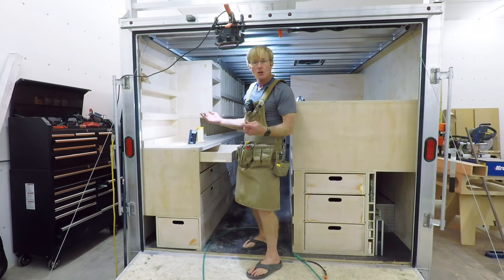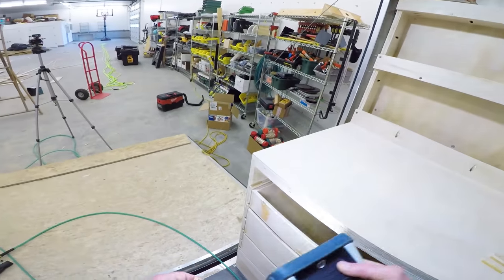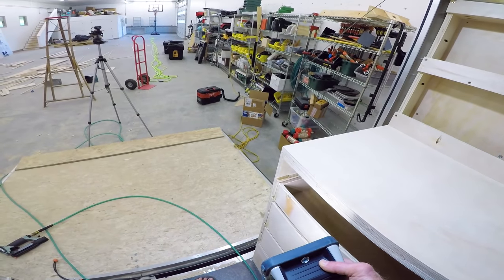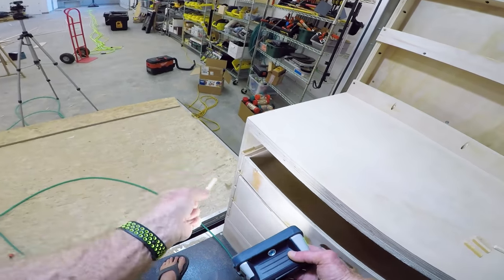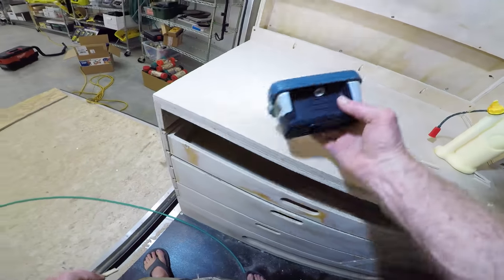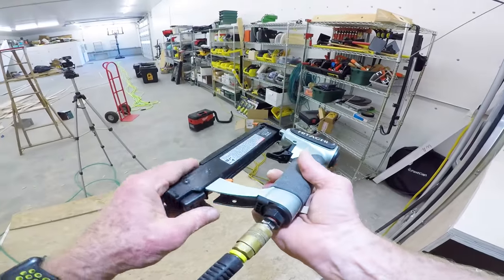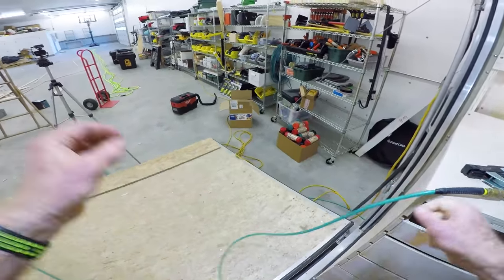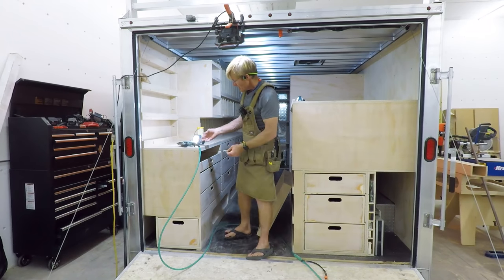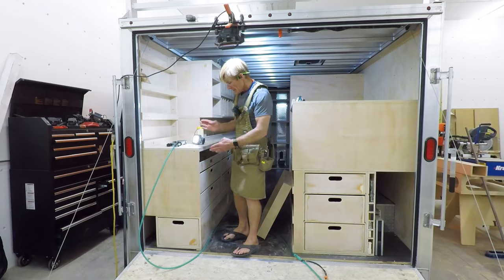I had designed it to do them on both sides but I've started with just one side. Before I put in the drawers I took one of these, glued it — that's the most important thing because glue is going to hold it over the long haul for banging on it opening drawers. I don't want it to pop out, so I glued it, put it in place, and then using a 23-gauge pinner with one-inch pins — those are 23-gauge, just a tiny little wire with no head — I was able to hold the gun in there and shoot three in each one.